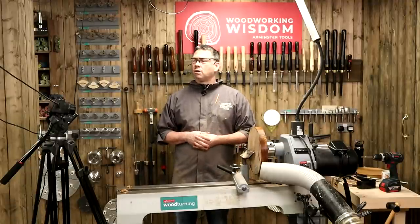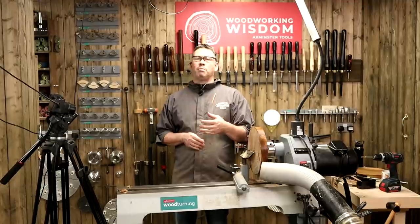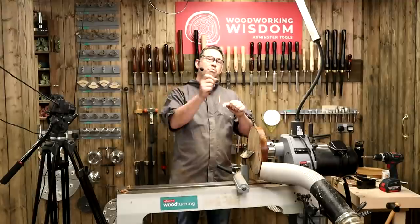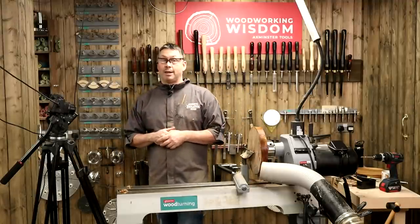No. And Paul's asking, what would you use over the spirit stains, lacquer or waxes? Spirit stain, I'd probably go lacquer, a spray on lacquer, because you don't disturb the surface. So once you've got your color right, spray over the top and it's left. Like I say, just no disturbance then.